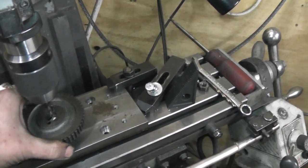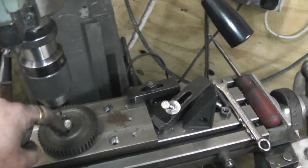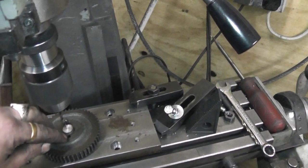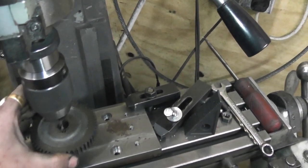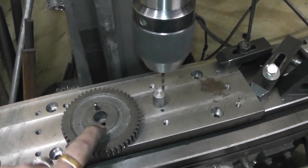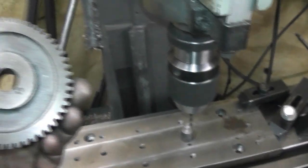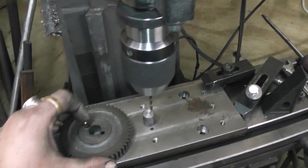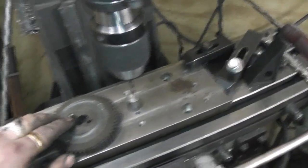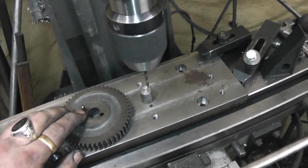What I did was put the gear over it and aligned the drill bit perfectly to get inside that hole — those 4.5mm holes on my gears anyway. And those taper pins, but I'm not bothered with the taper; I'm not going to do the taper pin method. I'm going to use 4.5mm pins, threaded M4.